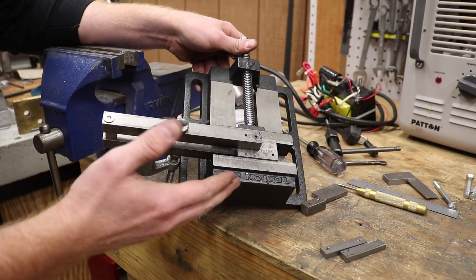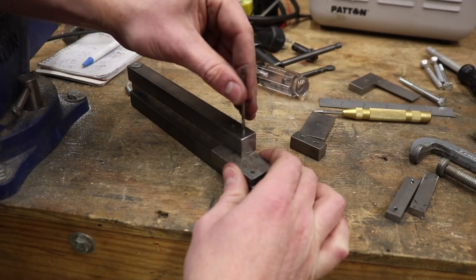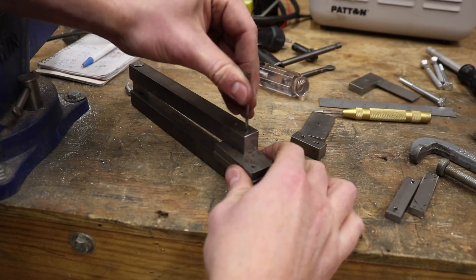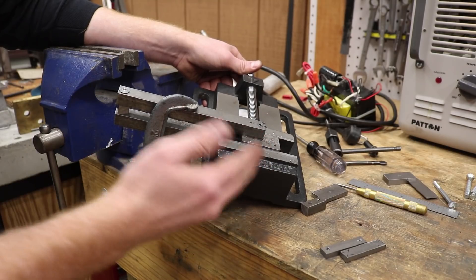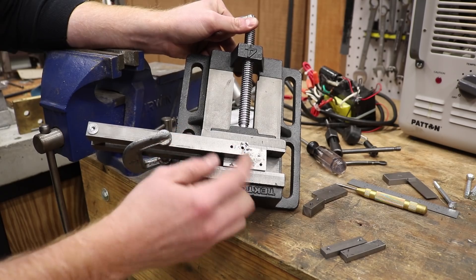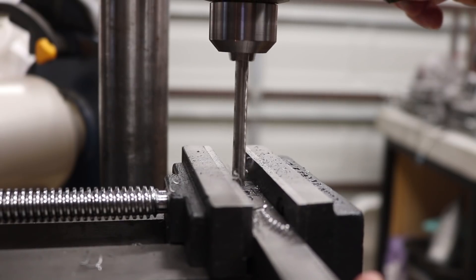It's always a little hard to get these things set up. I used my drill bit to align the holes pre-drilled in three of the parts, lined up the last part where I wanted it using the bench surface, C-clamped it into place, and held the other end in my drill press vise. Then I drilled through the bottom member using a 3mm drill bit. I'll go through and enlarge these holes, drilling, tapping, and countersinking where necessary, and then this rear assembly will be completed.